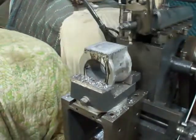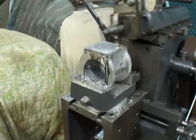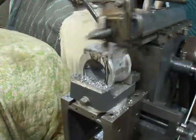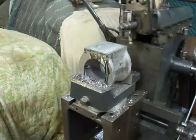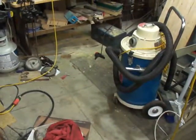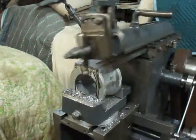Due to the high silicon content in it, it's actually as hard on cutters and as abrasive on cutters as cast iron is. It's also abrasive on the machine, which is why I'm running the sweeper right after I get done here. I've got an industrial shop vac that I use to suck up lathe shaper shavings — makes it real easy.